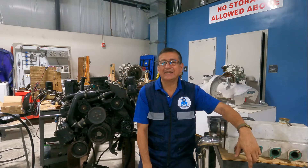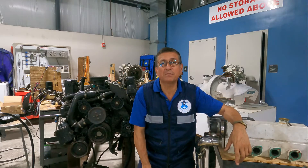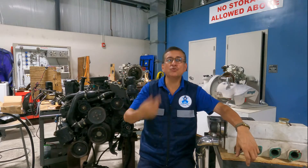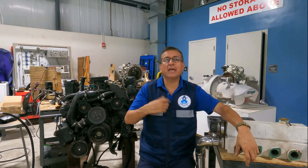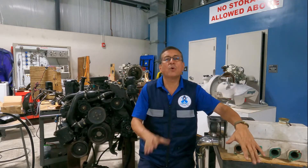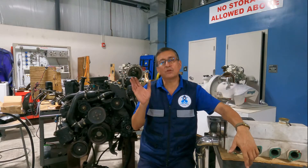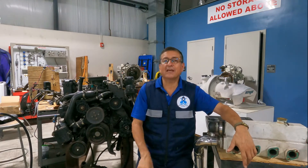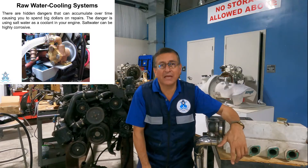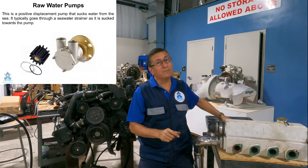It's not ideal — the raw water is stagnant in the engine, especially if the engine is not used periodically. The recommendation is to use the engine periodically and constantly. That's the best way to keep a boat in good condition. In a raw water coolant engine, both pumps — the raw water pump with a flexible impeller and the coolant pump or circulating pump — are involved.